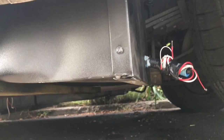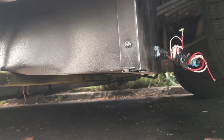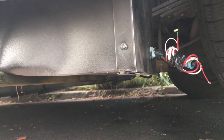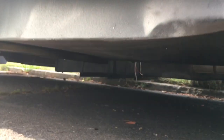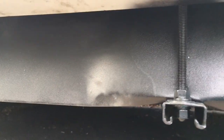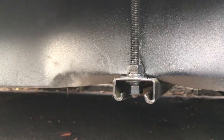Here's the gray water tank up there. We still gotta do the electrical. The electrical there is for the sensors, whether it's full, empty, or low, or whatever. And then the tank heaters. So that's still got to go in. The other wires are kind of hanging down right there, so I got to put them together. I kind of had to squish it a little bit to get it up in there. But it had like a 3/4 inch play room inside it, so it didn't really hurt the tank any. But that's what I had to do to get it up in there.